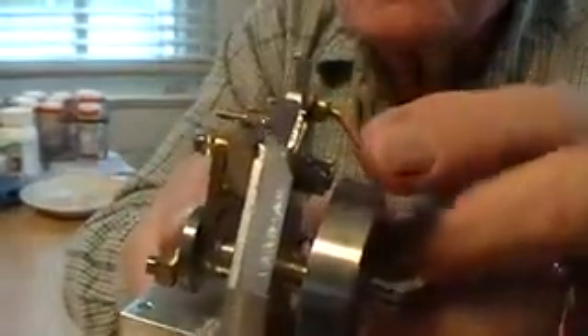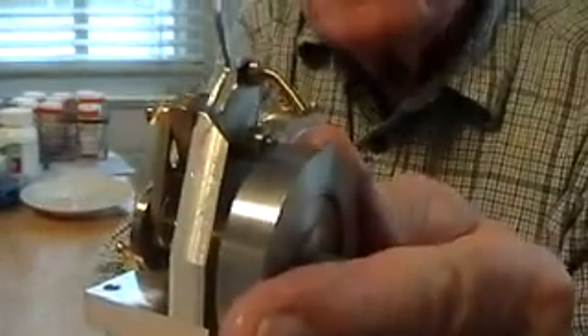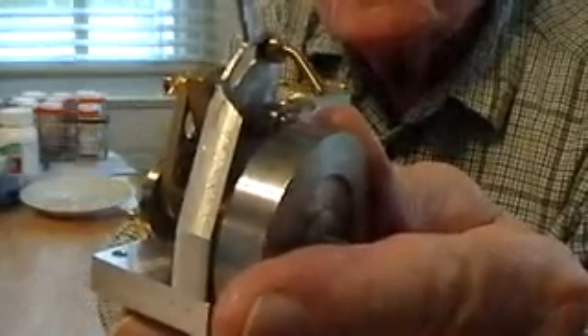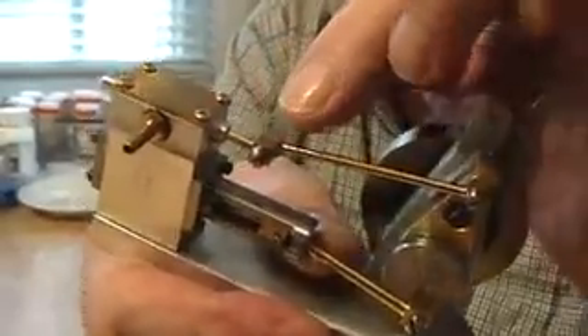There are other rather peculiar things — this little handle. They say you must machine it straight and then bend it. I thought, can you really bend this brass without annealing it first? It's very easy to anneal and soften brass, but no mention was made of it. Well, I made two and broke them. Then I decided to make them to my own specification — a little thinner, anneal it first — and lo and behold, I could make it.